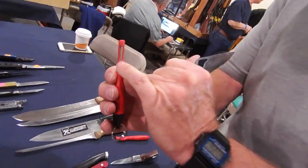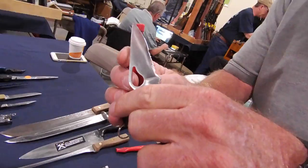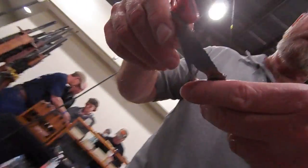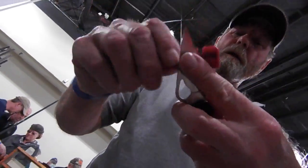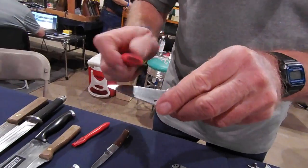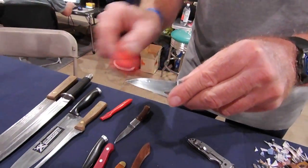What I do is there's two corners — corner right there, corner right there. I touch the corner to the cutting edge on a 10-degree bevel up like this, and then just go right on around. The other side has a little bevel on it, so match the bevel there. You've actually got it beveled all the way back — probably did that with a grinder.